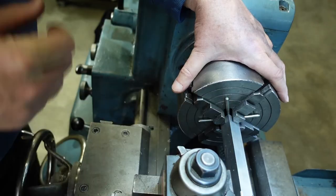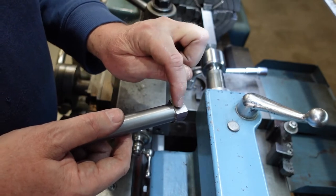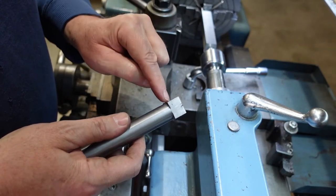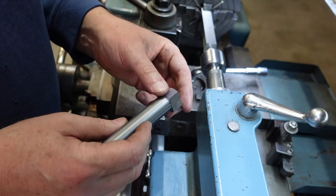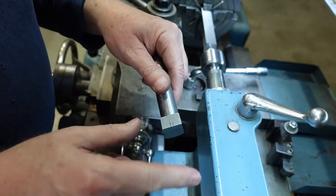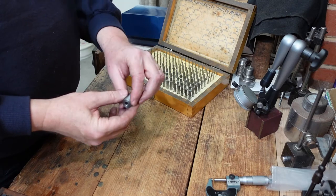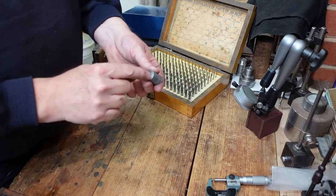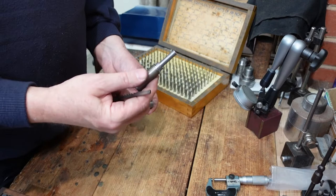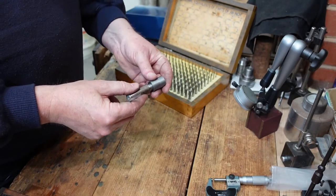Here's the first piece — I've got minimum cleanup, almost running into the flat on both sides. I'm letting it cool down; once I've done this piece I can turn them around and turn them into nice round stock to cut up into worms. This is a worm blank, oversized because I'm going to machine it down on a mandrel. To put the keyway in I need to make up a bush to go in there.